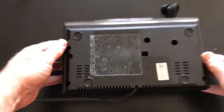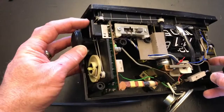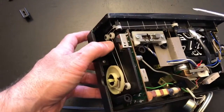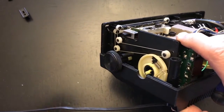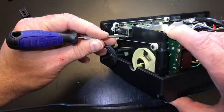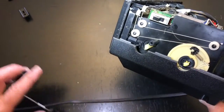We've taken the speaker off the top part of the cabinet. What we have here is the internal part of the FM/AM switch. We're going to put a little contact cleaner right in there before we give up on the radio. It doesn't fix this clock's radio, but doing it on the other clock actually makes the FM come in better, so this step is important.